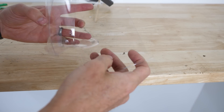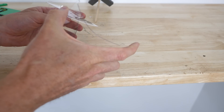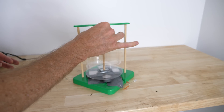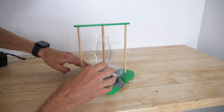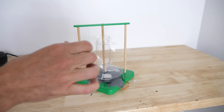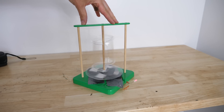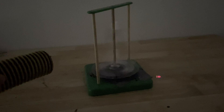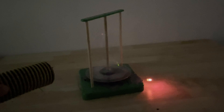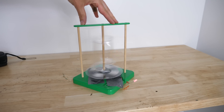I'm going to curve these plastic sheets so they'll catch the wind, and when they do, it'll cause the magnets to spin. When the magnets spin, it will make electricity flow through the wires and I can generate a voltage. Now I've hooked an LED on the wind turbine. Let's blow some air on it and see if it works. It works — look at the LED light up! So I made my own little mini wind turbine. Now let's head out to the road and see if cars driving by can actually turn this.